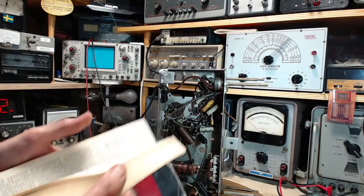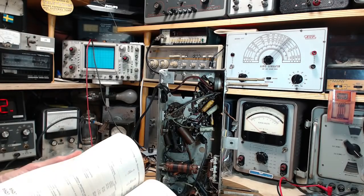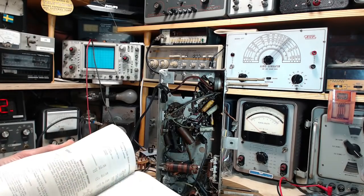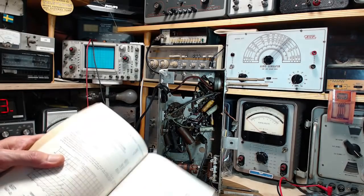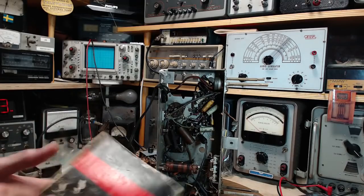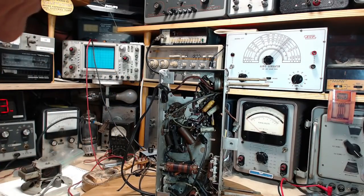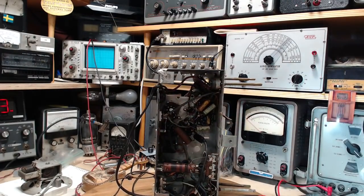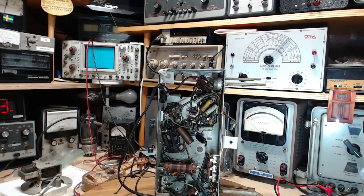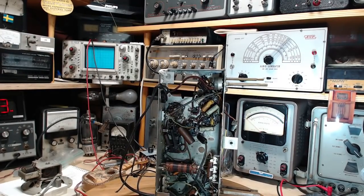6SA7. I gotta double check everything. Can't believe this. 6SA7. I was so careful to get this all right, step by step. 6SA7. Heaters are 2 and 7, just as I thought. 2 and 7. I get down here and take a look. Pin 2. I'm doing all this again. Yeah, I had the wrong pin. Wrong pin.